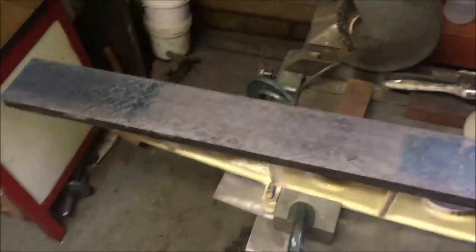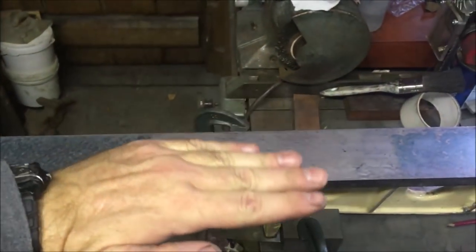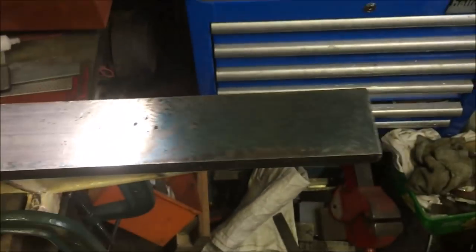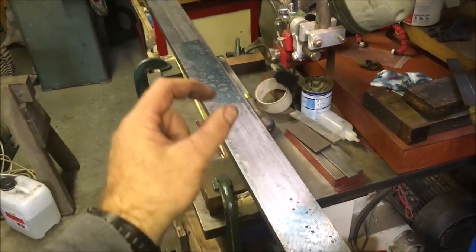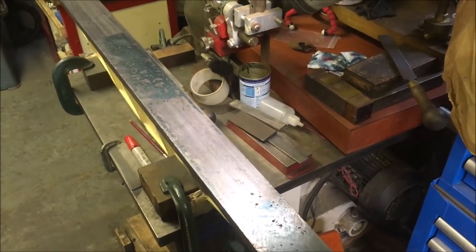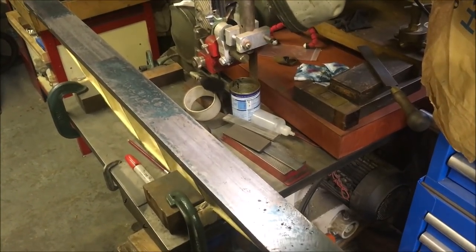So what I've done is I've printed from that end to the middle by bringing the surface of the straight edge into that and pivoting it down. So you can see it's printed there blank and then printed that bit, and then I've done the same from the other end, which quite clearly shows the bump in the middle. Now obviously there's a fade out, but it's surprising how that's, as I say, 2/10, just over 2/10. No, just under 2/10. So I'm going to work that down now.